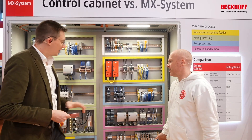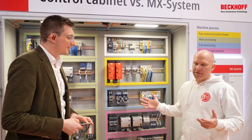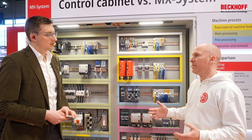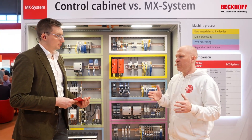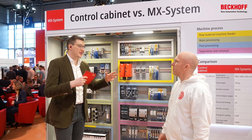Color is maybe not the best example — it's also mixed up here. The traditional way, and still many people work like this, is that you start with the power supply, with the incoming power — the big stuff. Then comes the power distribution, maybe the drives, the motors and so on. Then we start with the lower voltage stuff, the 24V or 48V and the distribution of the control voltage. And finally, the IPC or PLCs and the IOs. But nowadays we have a standard for functional-oriented engineering: IEC 81346. This means when you have a machine, you divide it into several modules and functions, and you represent each function in the electrical drawing — if possible on one or two pages — which makes it easier for electrical designers and maintenance people. So you are following with the electrical design the actual machine design.